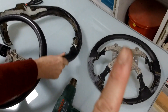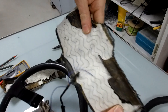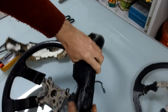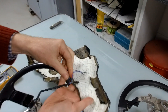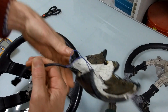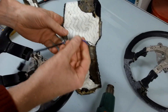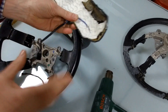Inside a stripped steering wheel you've got all these wires, which are heating wires underneath the leather. The key to it is you've got four wires on this connector. The fat outer two do the heating wires - that's high current that gets hot. The inner two, these funky blue wires, are the temperature sensor that sits in there.